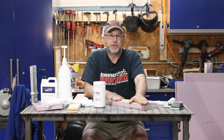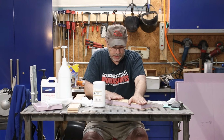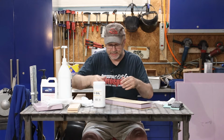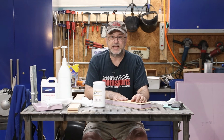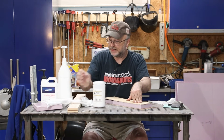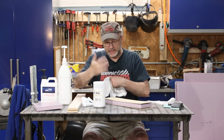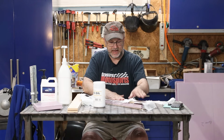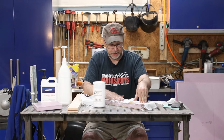Put some bricks on it so that it's held flat overnight to make a good bond. And then, this is going to be a multi-day process. So that'll be day one, getting things bonded together, putting some bricks on it. Day two, I can take the bricks off and I can do fiberglass on the outside, my 10-ounce fiberglass. That'll give me most of the strength for the exterior.